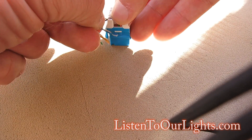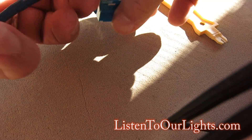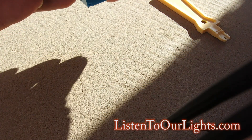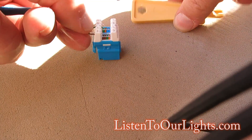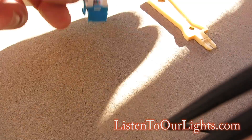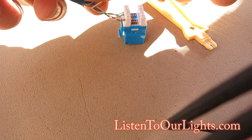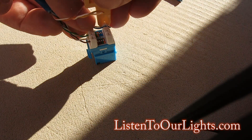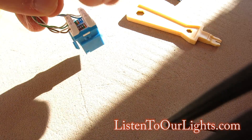This little kit I bought is about $3.50; the more expensive ones are around $7.00 and probably come with the punch down tool. The next one is green, so I have green and then green stripe — going with the A configuration. I push it down, and there are little teeth that bite into the wire. Then blue and blue stripe get pushed down. Almost every one of these kits comes with the markings built in, so you don't even have to remember what the standards are.